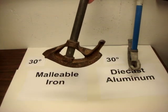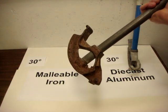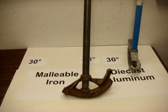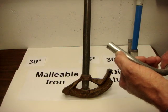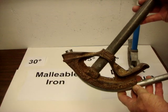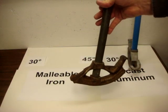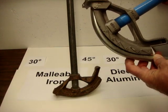This one is the one that I have used for over 30 years. It could probably use a little cleaning and painting, but it is very serviceable. One of the many features I like about this one is that when you bend, if you make a mark at the 5 inch mark in order to bend a 6 inch stub and put this at the star, it is the same as subtracting 6 inches and just going to the top of the hook — much faster than pulling out a marker and marking each bend.